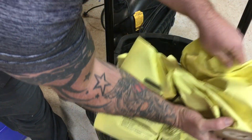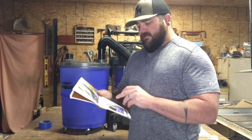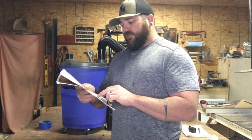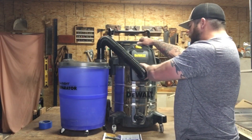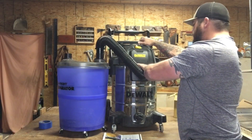So I consider this a success. The DustRite separator works like a charm. You can find these at Rockler — I'll leave a link down in the description below so you can go check them out. You can get them with different kits that have different attachments, hoses, and implements for whatever your needs may be. One thing to note from the instructions: some Shop-Vac hose fittings are slightly under two and a quarter inches. In that case, a couple of wraps of tape will make for a tighter fit — if your fitting is too loose, take a few wraps of tape around the metal end of the hose to snug it up.